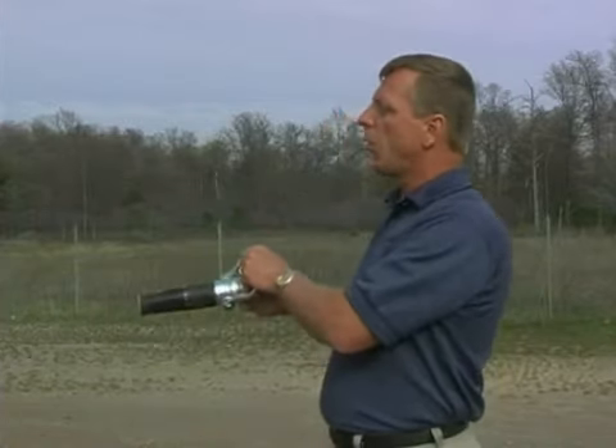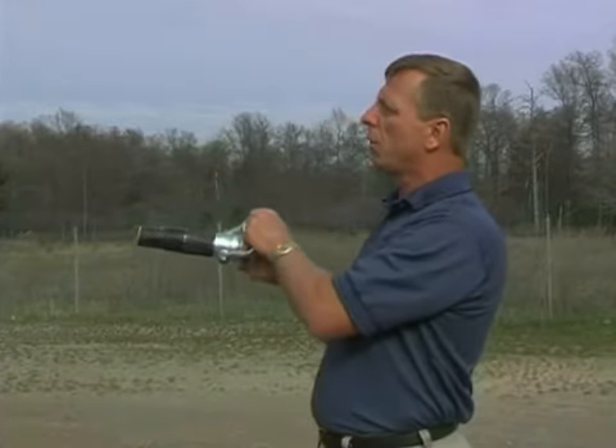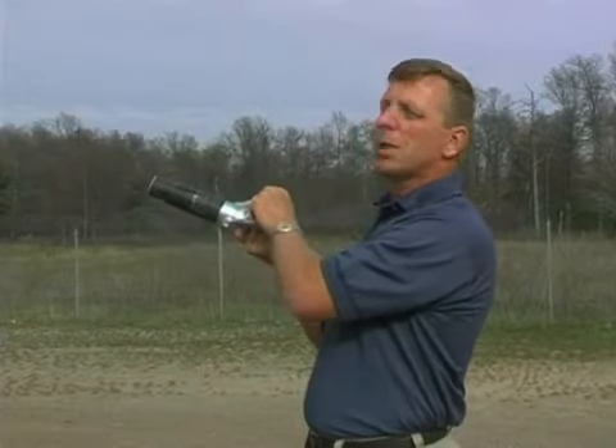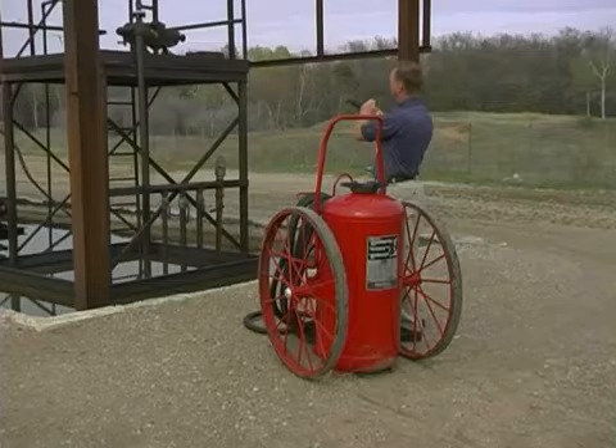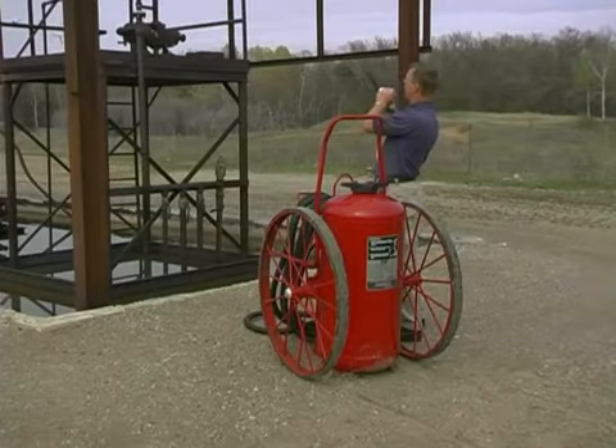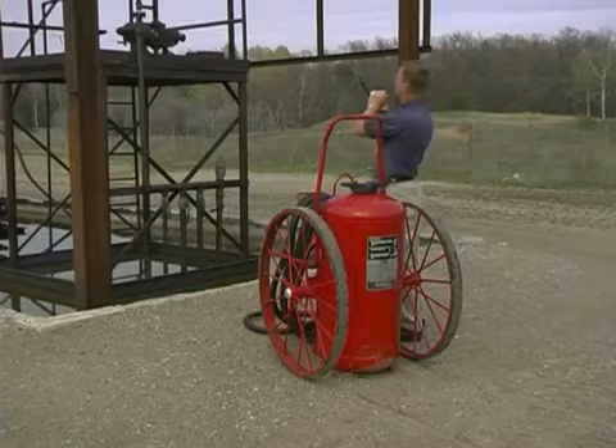Go up in the flow of fuel, staying in the flow of fuel, and putting the fire out as you go up. The last fire to extinguish is the pressure fire. Introduce the dry chemical at the break, and as the fire moves, follow the fire all the way out until it is extinguished.